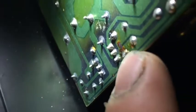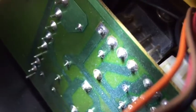I also had another one down here where the solder joints were cracked. I did notice I do have some discoloration in the board, so I'm not sure if it's gonna work or not. But I'm gonna go through and touch up them solder joints. You can see one of them's really screwed up.